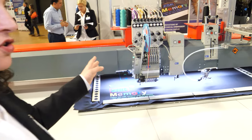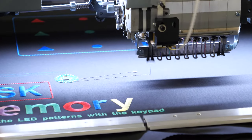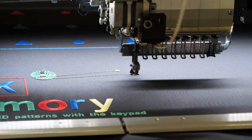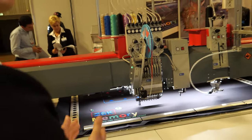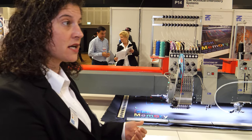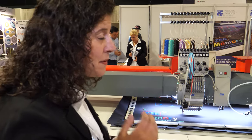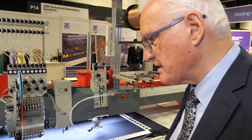You can combine conductive threads with wires, so for R&D purposes that's perfect. At the end, for production, you know exactly what technology you need, and then you have a multi-head machine where, for example, you have 10 heads on it, and by one cycle time the machine produces 10 pieces of your smart fabric.